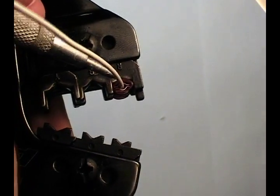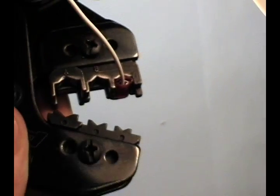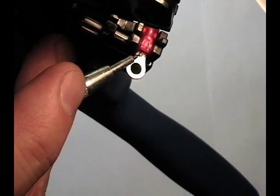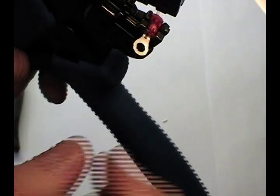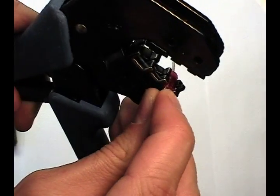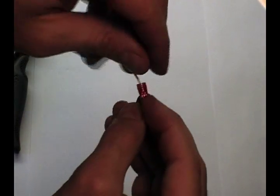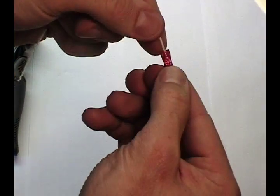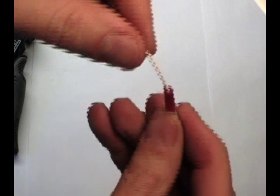Also notice the shape of the wire insulation grip. It's important to check all features. Make sure the insulation wasn't stripped too far. If the wire doesn't protrude beyond the terminal end, you must reject the part. Gently remove it. Give it a 5-pound pull test, or more for larger wires. And now you're ready to install the part.